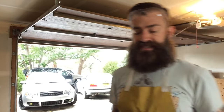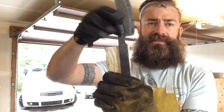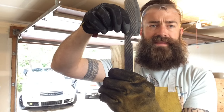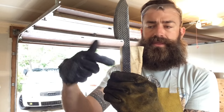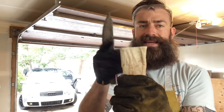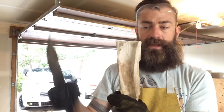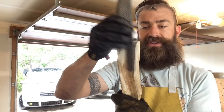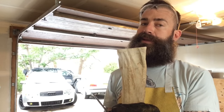Now I'm actually selecting the bone that I want for the handle. This piece right here is going to be more than enough. I only need to go up to that first finger notch. I need this side flat, this side flat, and the back side flat so it sits flush. The hand side is going to have a little bit of texture to it — I'm going to leave it that way because it's going to be awesome.